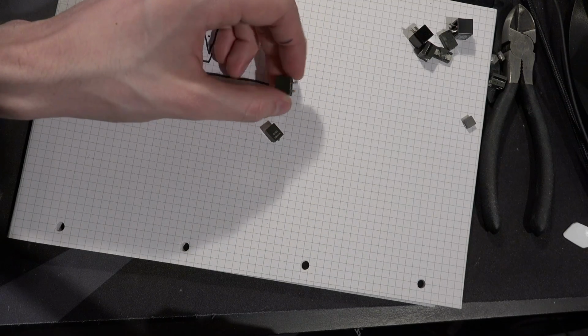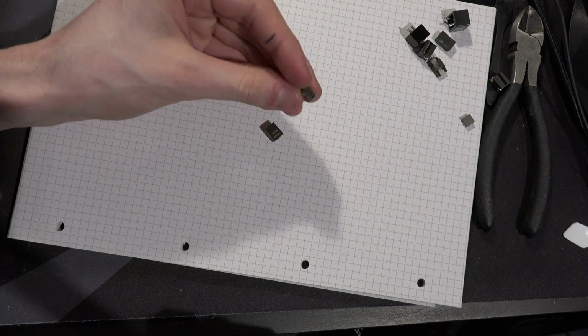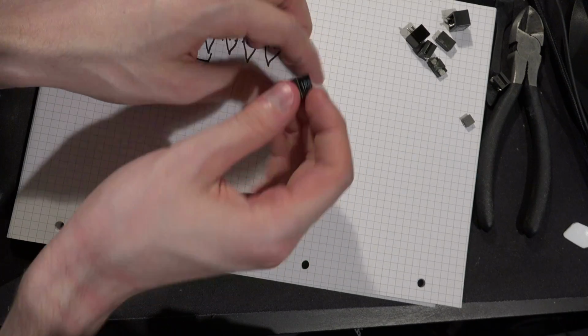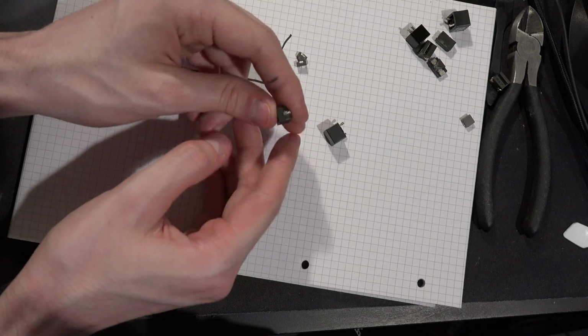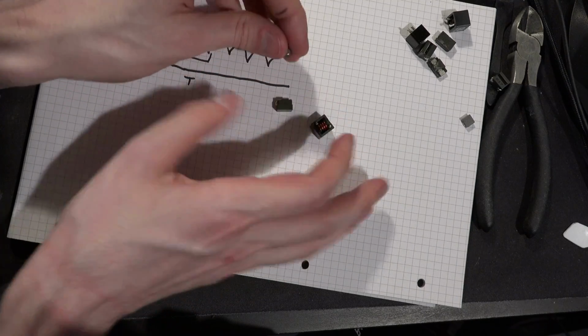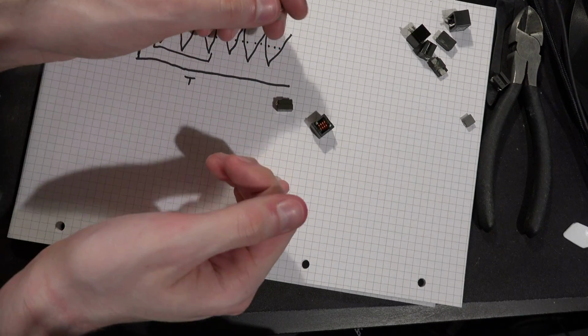I think Asus uses molded ones, where it's this style of construction where the core is molded onto the coil, but it's still a larger package and it kind of looks like these. But I still think Asus uses this style of construction. But even then, if your VRM is built up entirely of inductors that don't necessarily coil whine, you have to remember there's an input filtering inductor.